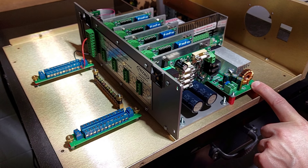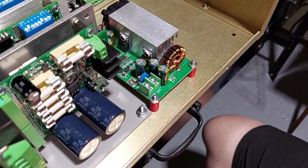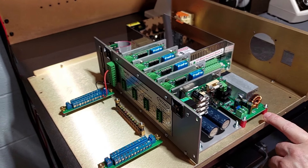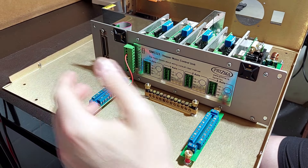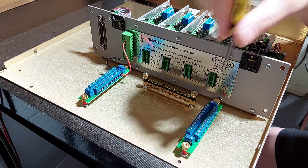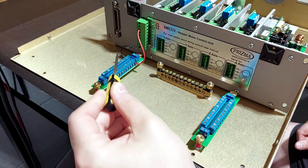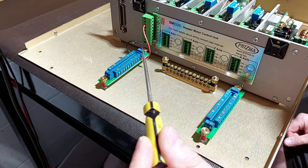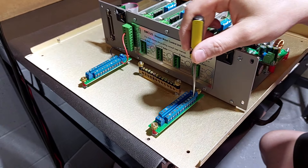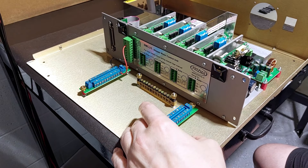We're only running 24 volts for switches and the UC400, so the amp draw is very minute — milliamps. But you want to make sure the unit is done correctly. I actually machined down the mounting to get proper spacing so everything is nice and neat. With the backplate removed and all wiring done, you can see just how easy this is to service. We've got a ground bus here toollessly mounted, power distribution terminal splitters — one red lead coming in off VSW splits all the way out.